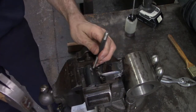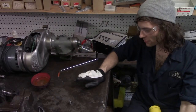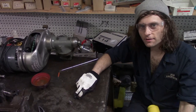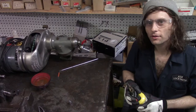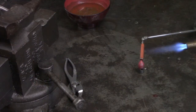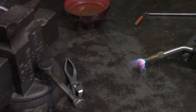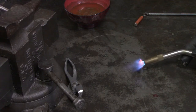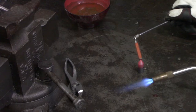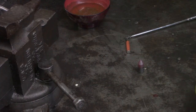You can tell I'm an amateur with the claw hammer. The final, final thing we want to do before I declare this project complete is to heat and quench our 60-degree center. It's W1 tool steel, so I've got some water here to quench it in. The magnet has stopped attracting it, so we are ready to quench.